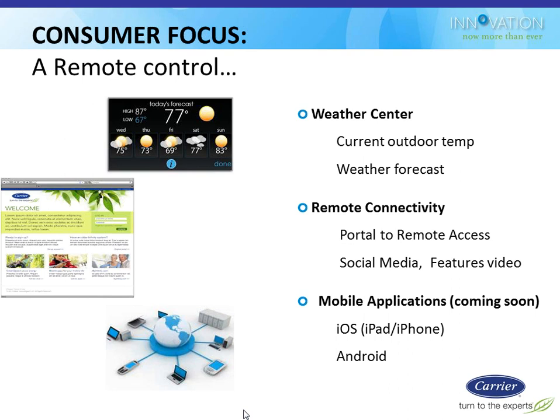A couple other questions came in. Will the online system ping the controller and alert the user of a failed internet connection? I would like to say yes to that, Vance, because I've used that on other products 5 or 6 years ago. But I set one of these up in our test lab here on Tuesday, and then I disconnected it, and it never gave me an alert. And I was getting all the other alerts just fine. So I'm going to say no. At this point in time, on this first release version, the website does not tell you if your thermostat lost internet connectivity, although I imagine that's something that will be included in the future.